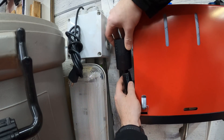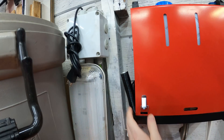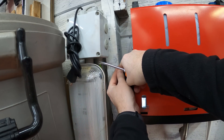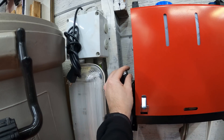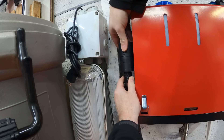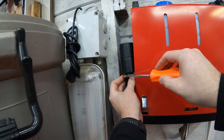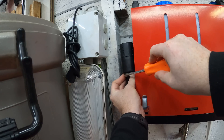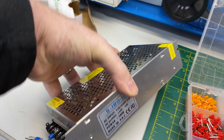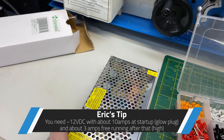I'm doing the intake inside here so I'm not trying to heat extra cold air from outside, which is going to be in the minus 20 range pretty soon. This cover will keep critters from climbing in — flies, spiders and stuff. There's a small metered orifice that the heater has to start on with the glow plug, and if you get any goobers in there it's not going to be able to start. So this is cheap insurance. This is a 15 amp power supply from Amazon — about 20 bucks, and the reviews are really good.